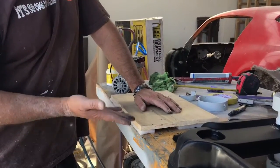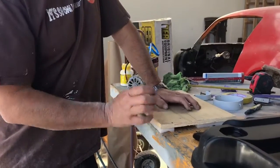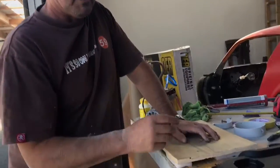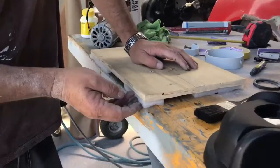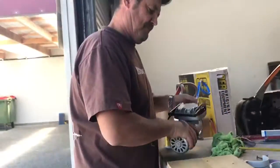I just want to get it up above the ground a wee bit, but also I want to have this foam here so that when the compressor's running, it's a little bit of insulation, because if it was just hard on the bottom, it would vibrate, it could eventually wear through the plastic or that type of thing, but it would also be quite loud underwater. So with this bit of insulation on there, it acts like a little bit of a noise buffer.